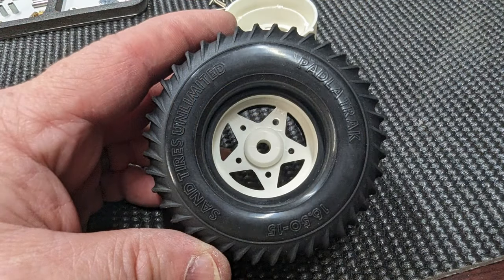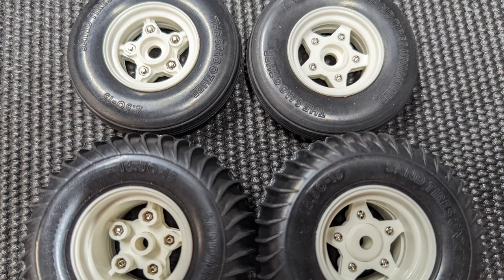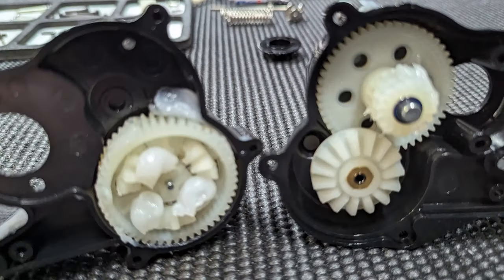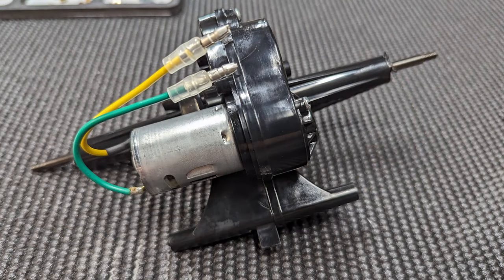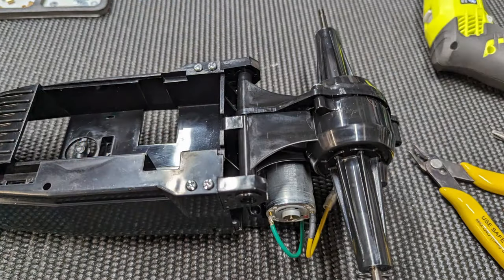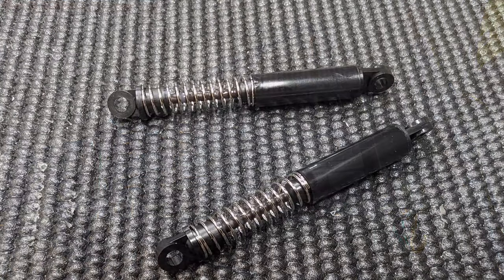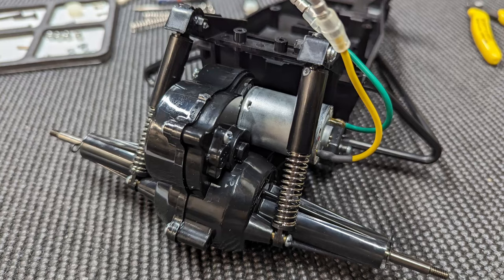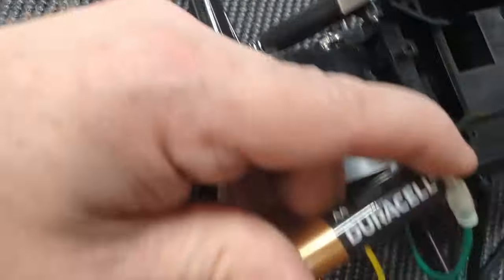Now everything is set. You're ready to put your fronts and backs on. I get my fronts on first, get them nice and lined up, and then we'll get the backs on and get those lined up as well, and that's where the tape comes in. Once you have them all lined up, you can screw them together, pull the tape off, and you have a set of wheels. And of course, we check the drivetrain to make sure everything is working nice with the AA battery. Everything sounds nice and smooth, so we're good to go.